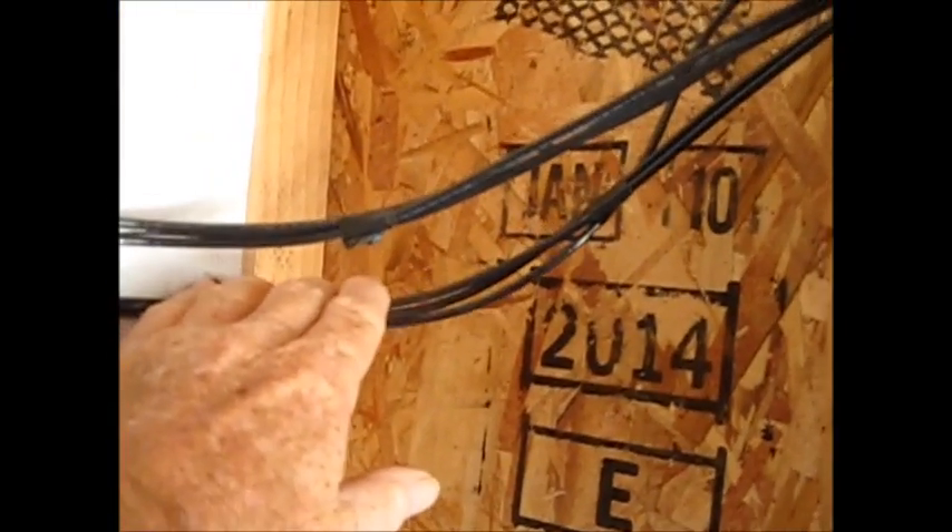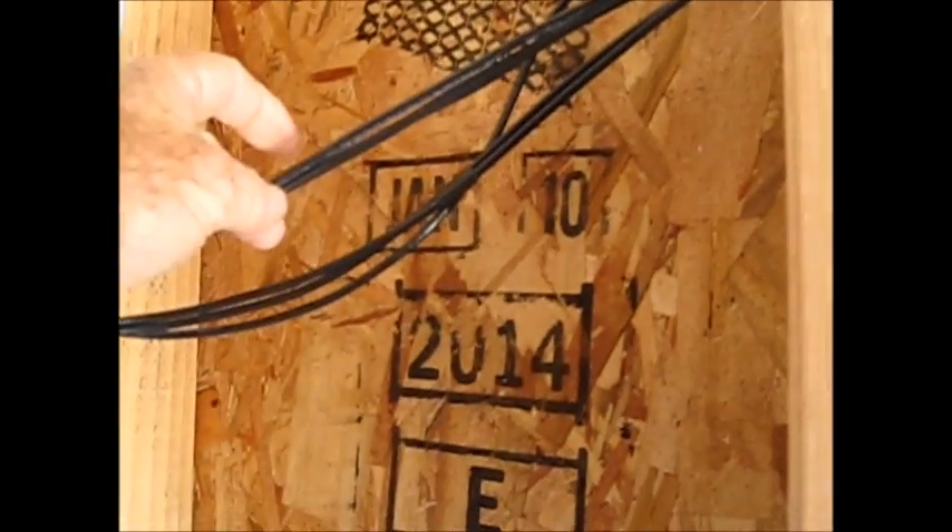Since I'm hooking up the Freedom, it's actually two separate 24-volt wind generators in one. I've got this running down through the chase, coming down where it'll tie in to where the line comes into the shed. Over here I got some Burndy lugs that I connected on the bridge rectifiers. Each of the bridge rectifiers has a little tab that comes out and has two holes in it. I got a nut and bolt and washer set to go through there that'll hold this lug in there really tight.